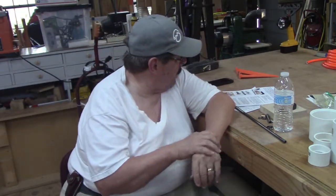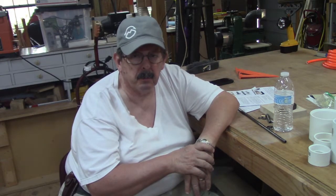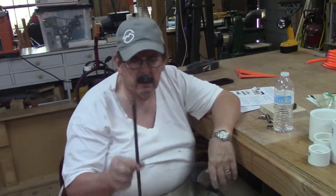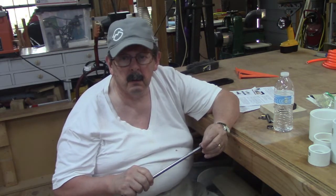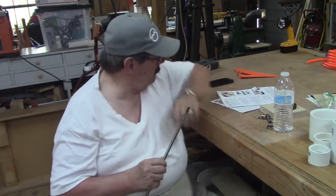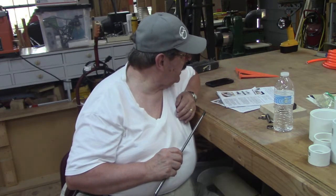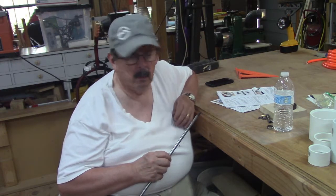So this is the part after reading the instructions. I read these instructions the other day, and I remember there were some pieces in there. So again, this is a lamp rod. It's got an OD of right at .39, plus or minus. So if I get my calipers out and turn them on and measure it: .384, .385.